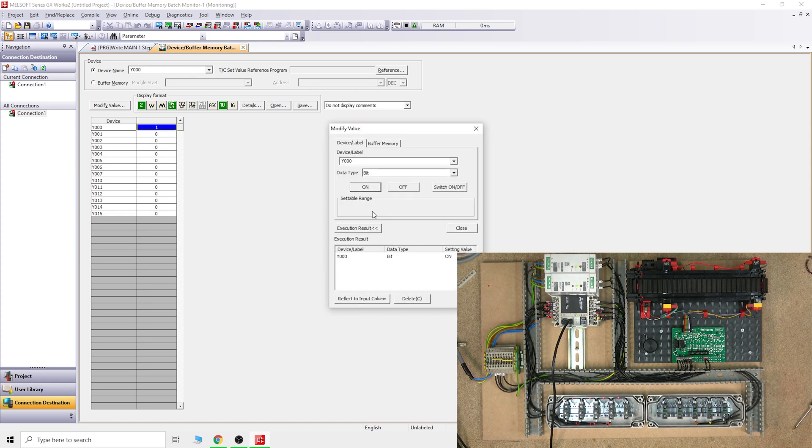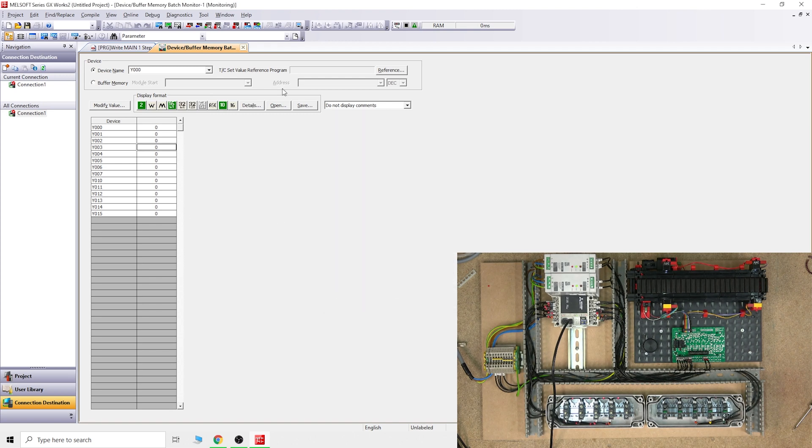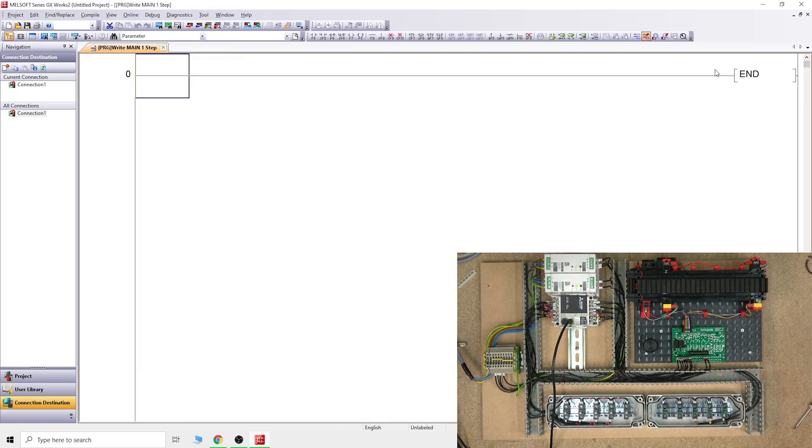To get the pulsar working, let's go to Y0 - it opens to all the Y's. Let's put it on - double-click on it and the belt's spinning, all good. Then go back to X0 and you can see the pulses are coming in, going on and off rapidly - that's the pulsar working. Y0 again to turn that off, and if you click Y1 that will go the opposite way - the belt reverses. Then Y2 and Y3 do some form of indication - all the lights are coming on as they should. In the next video we're going to be playing a lot more with programming, using some sort of indication with Y2 and Y3.